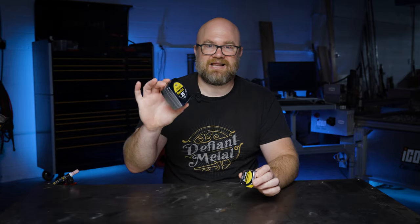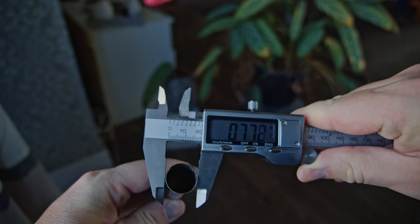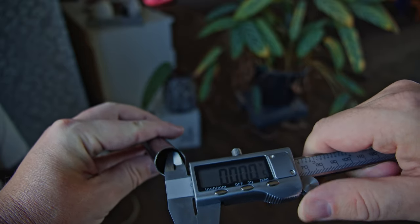Now for measuring options, obviously a tape measure is the way to go, but for metalworking, you're usually going to want one that looks more like this and not like this. One big difference in woodworking versus metal when you're measuring is that a lot of metal is measured in thousandths of an inch or fractions of a millimeter. So for that, you're going to need either a digital or dial caliper to get that precision.